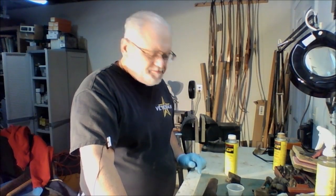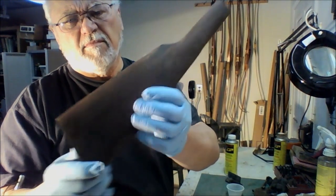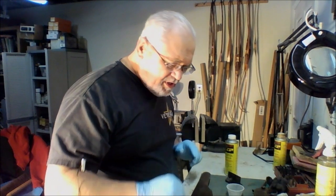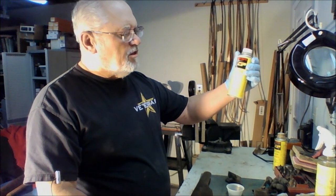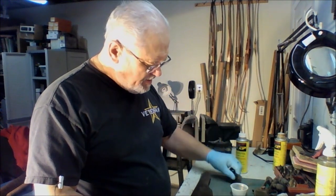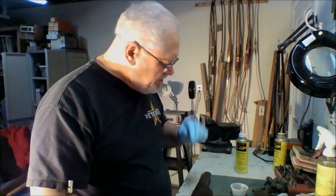Hello, 45 Alpha Charlie Papa, we are back. Our stock has been stained — it's probably darker than we want it, but that's okay. What we're going to show you today is how we do a sand-in finish. What we're going to use is our custom oil — it's a clear gloss hand-rub oil finish — and we need a small container and some 220 grit wet/dry paper so that it won't fall apart as we sand.